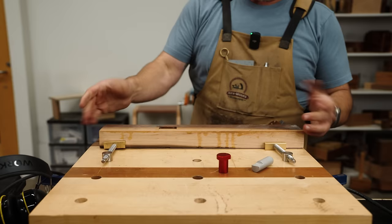We have straight bits — these are spirals. There are actually straight bits but I would not recommend using them; they're cheap, they dull quickly, and they create a ton of force. A spiral is a much better bit. There are three basic types: an up-cut, which is going to pull sawdust towards you — very much like a drill and great for doing through holes and through mortises; a down-cut; and a compression bit. The difference between up-cut and down-cut is the edge in which they leave a better finish. A down-cut is going to leave a better edge closer to your router because it is pushing the fibers down, and an up-cut is going to leave a better edge on the bottom of your workpiece because it is pulling the fibers up.